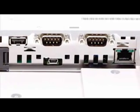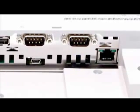To the right of the COM port 1 is the COM 2 port. This is an RS-422/485 port. As with COM 1, the pinout diagram is in the installation guide. Device-specific connection diagrams and Pro-face cables are detailed in the device connection manuals. Pinouts for the GP4000 series COM ports are different from the AGP3000 series COM ports. Be aware of this when migrating from the AGP3000 to GP4000 series HMIs.